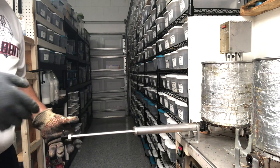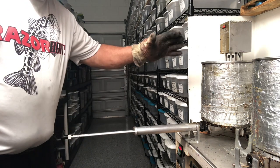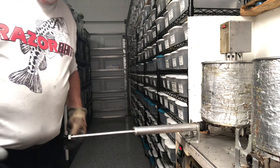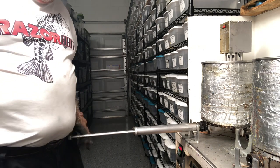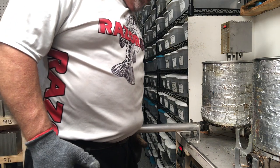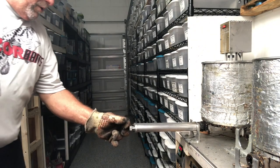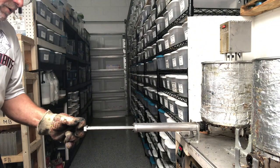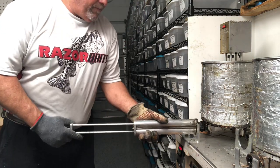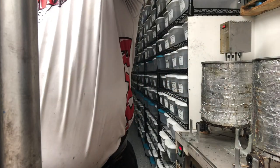Now the first time I fill my injector, I like to go back and purge it to make sure that it's hot enough and everything's going good. To purge, I push up against my hip and push it in, and it purges the injector. And then it had no air. So now I pull it out and I got it full, rotate it to turn off the valve. And now I come over and I'll shoot.